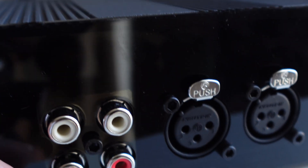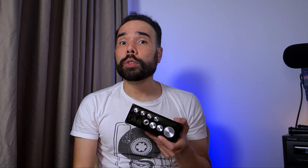What about the preamp output? Imagine you have another analog piece of equipment, such as a cassette deck, and you want audio to enter it with the best possible definition and volume. You would add less gain and consequently less noise from the internal gain of the cassette deck. Another use of this preamp output is to convert a balanced audio input into an unbalanced audio output. The headphone output is an unbalanced standard 6.3-millimeter jack, and there is no adapter in the box, so you need to have a cable or adapter.